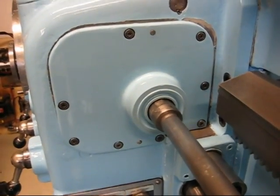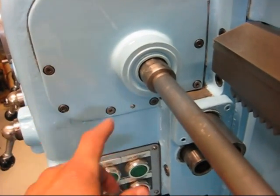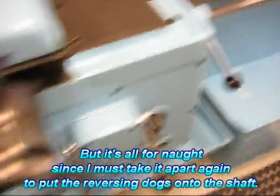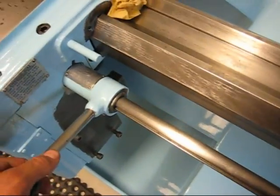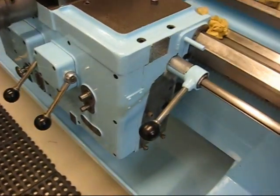It's on now and it's correctly aligned — a taper pin there, and a new taper pin in the shaft there, along with a grub screw in there that goes into the slot. And this is neutral — down and up. I think that's an okay alignment.